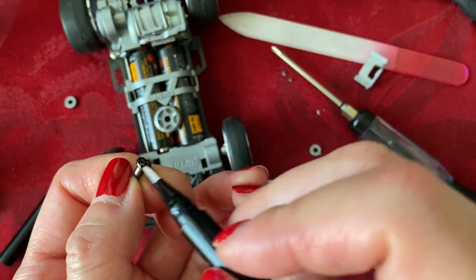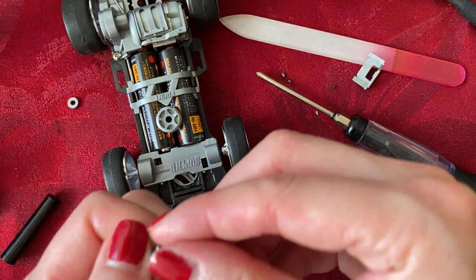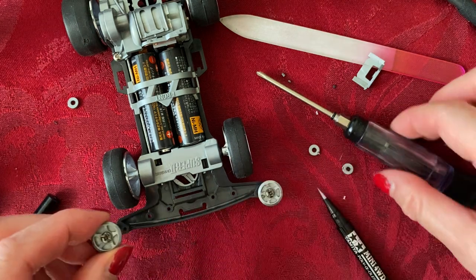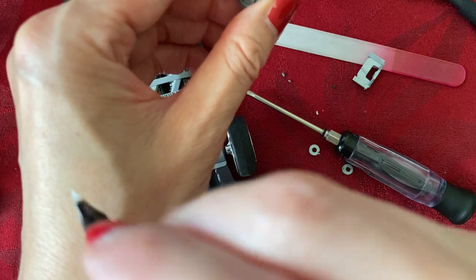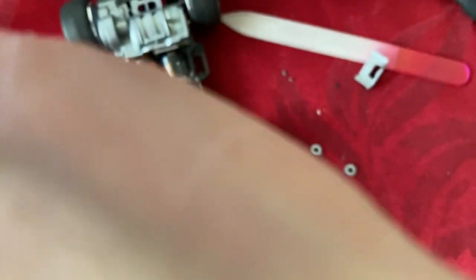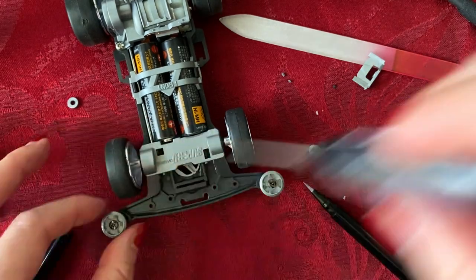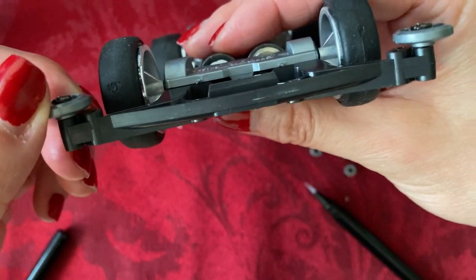When you get to a point where there's some resistance in the revolving screw, that should be where you stop — don't proceed any further. Let's do the last roller: lubricate inside, lubricate the revolving screw. Remember to replace your oil pen and grease tube if they're running out. It's pretty difficult to figure out how much oil is left in the oil pen without placing it on your hand to see if anything is being released.